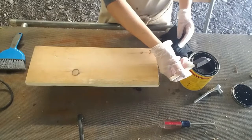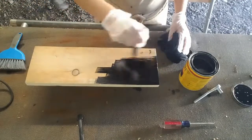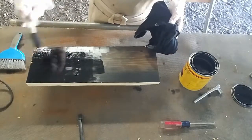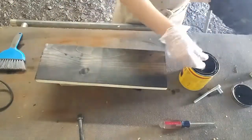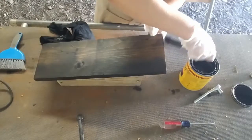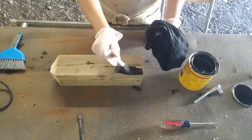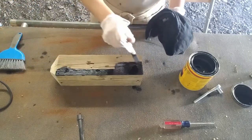You're also going to want to stain the board that you cut to fit the underside of your mailbox. You don't really have to — it's not going to be seen unless you get down and look up under your mailbox — but if you already have the piece prepared and you're already staining, it would be a good idea to throw some stain on it so that it all matches. By the way, I'm using a foam brush to apply the stain and a piece of an old t-shirt to wipe it off. I'm not refinishing furniture, so I'm not being too careful about dust and dirt. When you're applying stain and almost immediately wiping it off without letting thick stain puddle, you don't have to worry too much about dust and debris sticking to the wood.